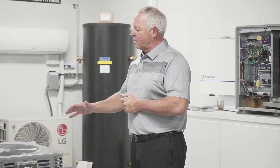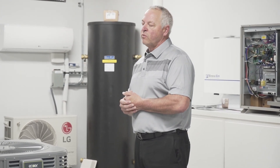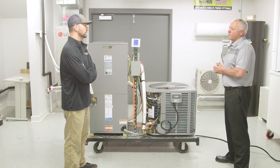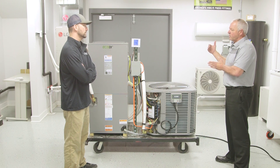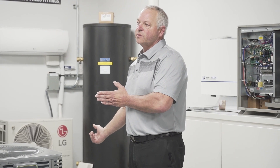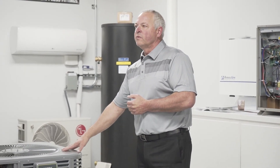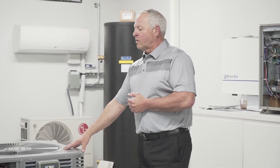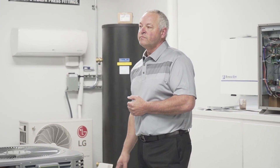Most of the time you're not going to see these running at full capacity. When we look at the three-ton and five-ton, I recommend utilizing the full capacity because I want the ability to produce as much heat as I can as the outdoor temperature drops. Unlike traditional equipment, we're much more forgiving if we're oversized in the air conditioning mode — we'll simply ramp the compressor lower if we don't need that additional capacity. In the heating mode, that's very nice.